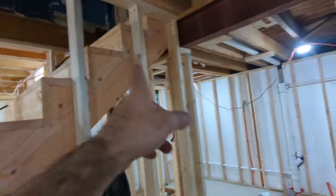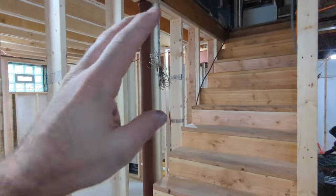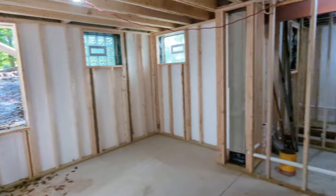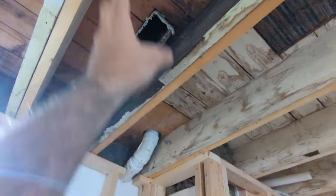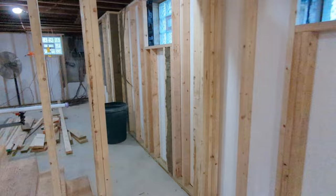If you go around that way, you've got to go underneath the beam, and underneath the beam in the bathroom in there, which gets real low. Or here, you've got to come through underneath this beam in here. So you've got to chew up this headroom right in front of the window. You'd be coming through here with big ducts. See, this is why I hate forced air, because you've got to get over here to supply this room here, and to go up these and go upstairs. It's just a no bueno system. I don't want to see them doing it here.